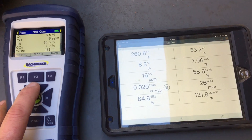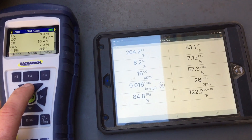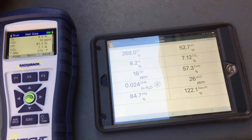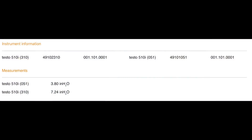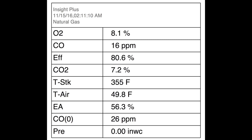Generally speaking, they compare very well and the system ended up running pretty decent. I had to take my gas pressure up to the maximum 3.8 inches with inlet at 7.24. These were the numbers that I finished with on the Bacharach — the report comes out nicely, nice and simple.